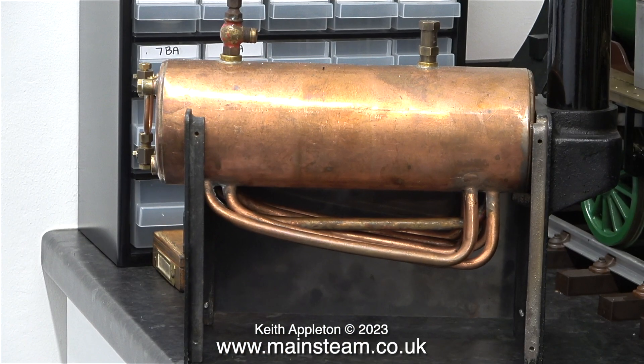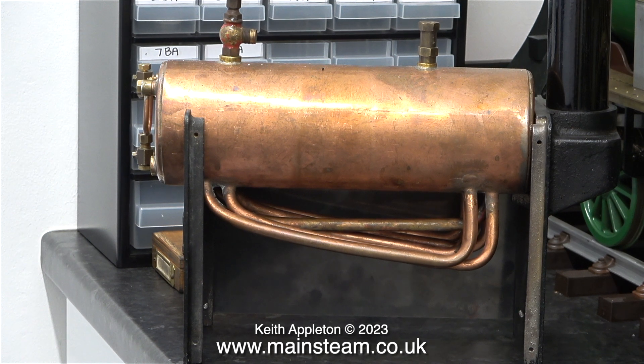That's it for details about the internal combustion engine in this episode. I'd like to show something which uses external combustion. This is a Stuart 504 boiler with one side removed — it's a Babcock type boiler. This design uses external water tubes to increase the heating surface area, and the centre tube is a super heater.